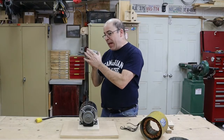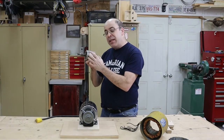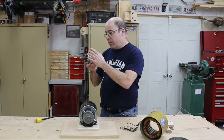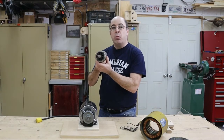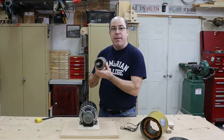That current actually creates a magnetic field inside of the rotor that is attracted to the rotating magnetic field in the stator. Now under normal circumstances, a motor with the rotor turning actually helps regulate current flow. We call this counter-EMF.